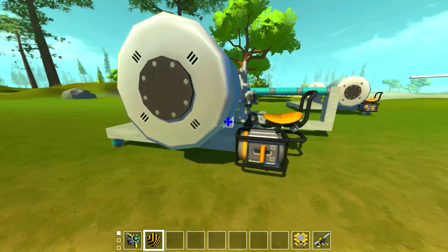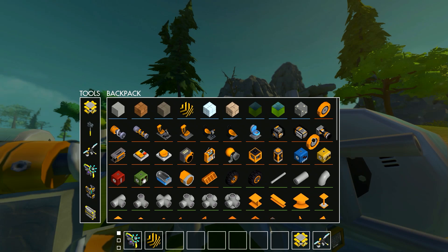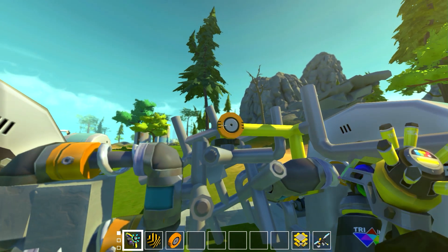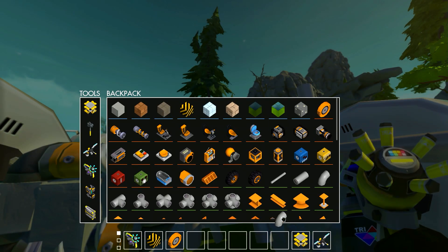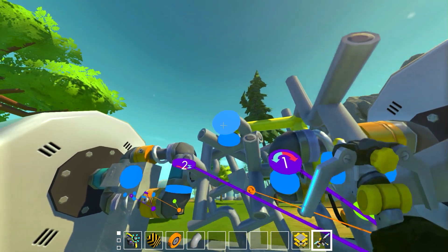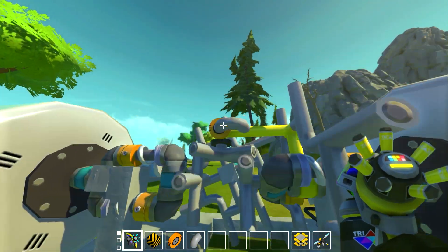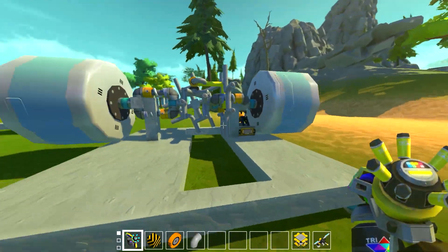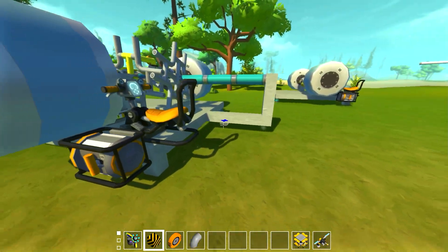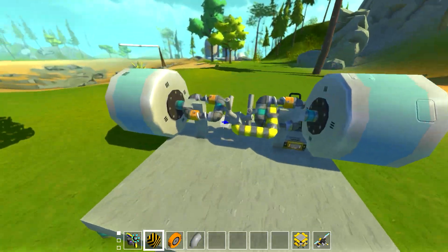This little pin here — you might be wondering why there's a little outpost here. That's actually so we can mount a diff lock. If I wanted to mount a diff lock, all I'd need to do is put a bearing down there, add a couple of small pipe pieces on a controller, and swing it down to lock that center gear, which would in turn lock the differential.